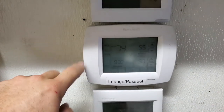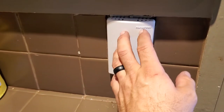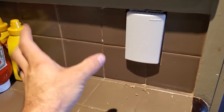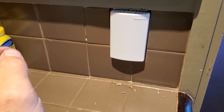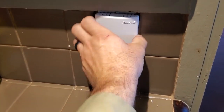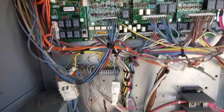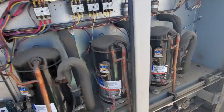The thermostat is installed. Now I'm going to install the zone sensor. There's still one of the old ones left, but it's not problematic at this time — the kitchen has already been changed. Also installed the new zone sensor. One thing I want to make sure of is to talk to them about not setting pitchers of ice water right next to that sensor, because the cold from the ice water could be radiating onto the sensor making it think it's colder than it's supposed to be. I went ahead and ramped the cooling down and got first and second stage to turn on — we know the thermostat is correct and the wiring is good.